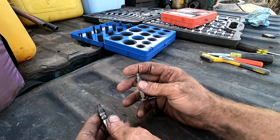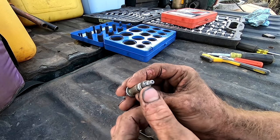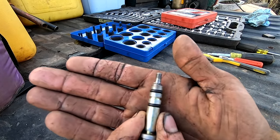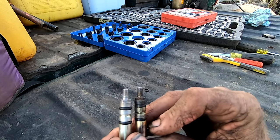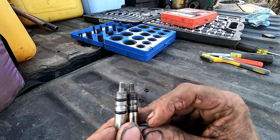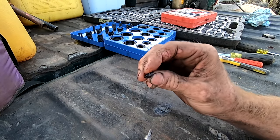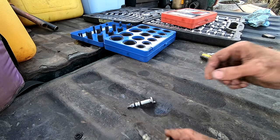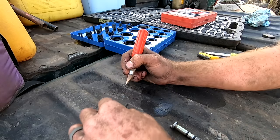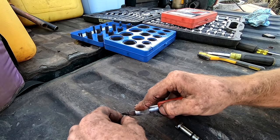All right, I replaced the O-rings on the shutoff shaft, and you see how they slightly bulge out past the shaft. And here's the throttle shaft. You can see how they're flat and definitely not sealing as well. This shaft was exactly like this. These O-rings were completely flat on the sides, and so over time they just break down. I found that a metric 009 was the best fit out of the metric and standard O-rings that I have in the two kits.